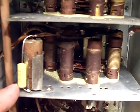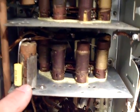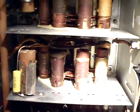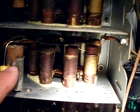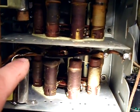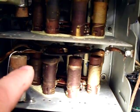This section is starting to get hard. This is a 0.05 microfarad capacitor and there's not enough headroom to get the old tubular capacitor out. So I just soldered it to the wire that was going to the capacitor, then cut it after soldering - it goes to the coil here. The new lead wasn't even long enough to reach the coil, but it's really better in my opinion not to be soldering directly to the leads of the coils because these coils are touchy.